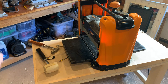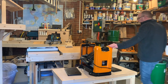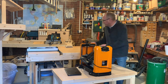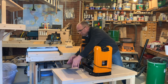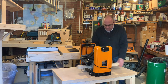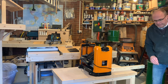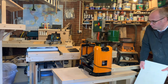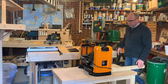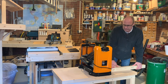Now onto the table. The planer thicknesser is mounted - really pleased with that, nice and secure. I've just removed the in-feed and out-feed tables, which was really simple to do. I'm going to put my own table that runs all the way through. The first thing I'm going to do is build a platform either side, then run something like melamine board all the way through the full length, which gives me 1.2 metres of table. That should help the material glide through really nicely. I'm probably going to use something like this 3x2 - nice and solid and rigid.